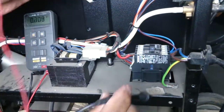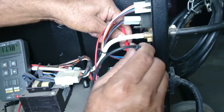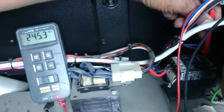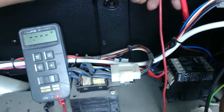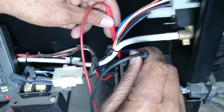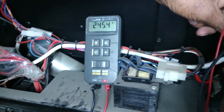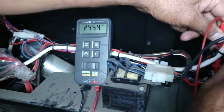And then we'll check the contactor input voltage. We are getting 240 volts to the input voltage. And then we are going to check the output voltage of the contactor — it's 240 volts as well, 242 to 245 volts at the moment.